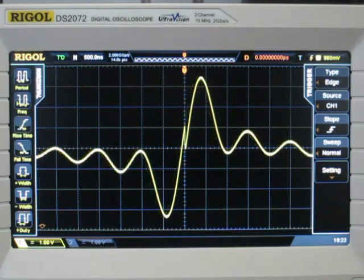Well, the math says that given the 20 nanosecond time base setting, and given the, say, 50,000 waveform refresh rate of the Rigol versus 35 waveforms per second refresh rate of the O1, the average test time for the Rigol would be about 8.2 minutes to catch that glitch, and the average test time for the O1 would be about 5.4 days to catch that glitch.